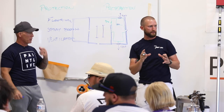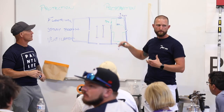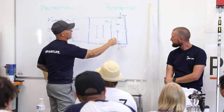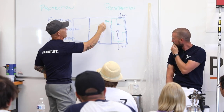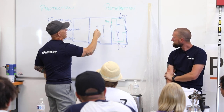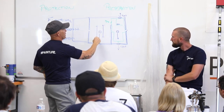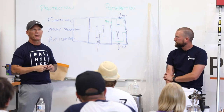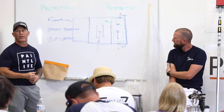Every kitchen's going to have a slightly different configuration. We had an air scrubber sitting here pointing that direction, forcing stuff to that fan. You could also have an air scrubber here pointing toward this box fan, which is pushing stuff outside the house. It's about developing some type of strategy to ventilate and move air in the right direction.